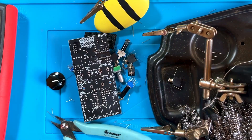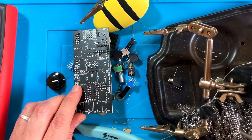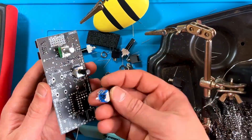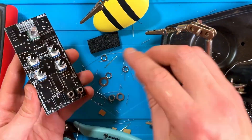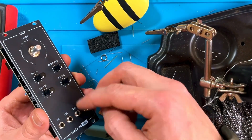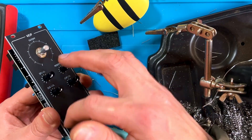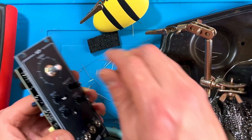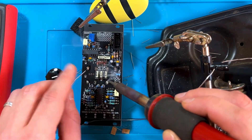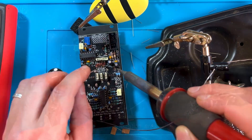Let's move on to the panel components. Place, but do not solder yet, all of the pots and jacks. The pot with the metal shaft goes on the top position, while the tall trimmers take the four positions below it. Now slip on the panel and finger tighten the nuts to keep it all together. Check to make sure the tall trimmers are centered and are not rubbing against the panel holes. Then turn it all around carefully and solder everything up.